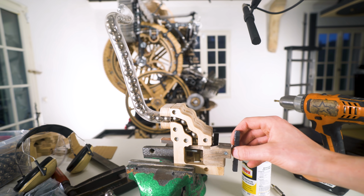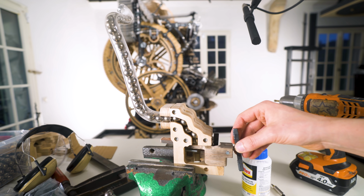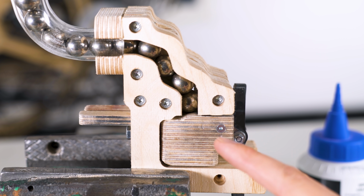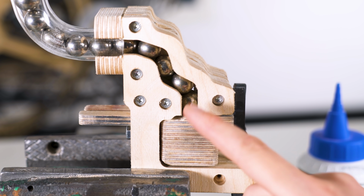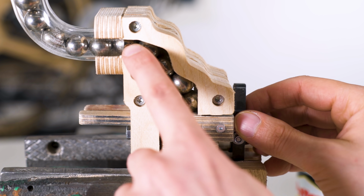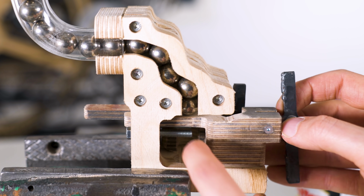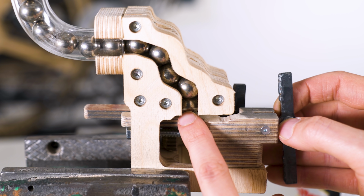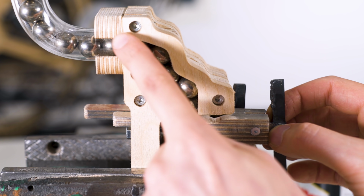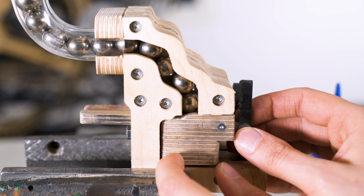Wow! It's effortless. There is more than meets the eye involved in this design. So I explained in the CAD live stream how the marble position in the closed state is calculated very specially because we want the marbles to fall into the zigzag in the open position. And that's exactly what's happening now. You see the bottom marble is riding on the lower 3mm thing. And this is the moment where all the pressure is taken care of by the zigzag geometry. And then when we close again, the cube ends up in this half state.